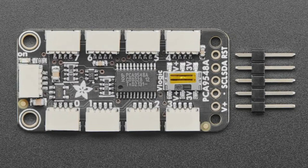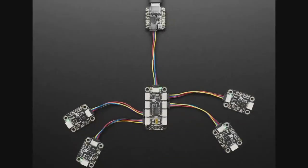And that basically lets you, without any special wiring, without any jumper pins or whatever, connect to 8 different devices with a very little amount of code that just has to go in between when you want to select between the different ones. It works very well. We've got Arduino and CircuitPython code examples and Python examples. So let me show it on the overhead.